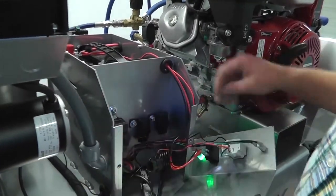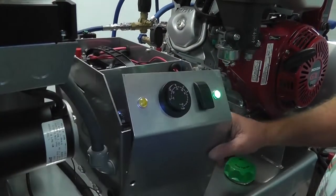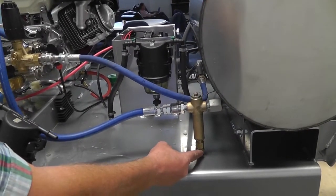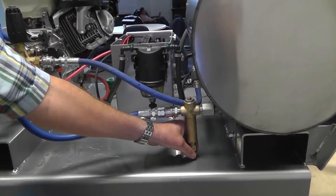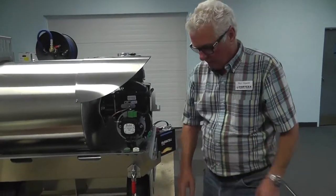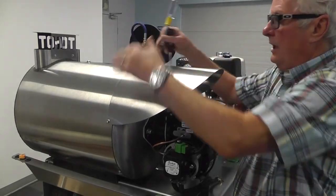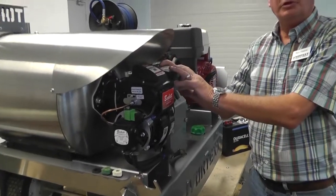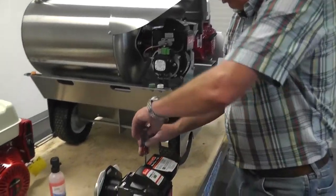If the burner will not kick in, you have a thermostat right here — that's the thermostat control that goes to the other side — and from there we'd have to go into the burner. Right here is where the thermostat is located. There is also a relief valve here on the bottom that if it causes steam in the system, that's going to relieve. If that ever goes bad, you need to replace it completely, not just reset it. If we want to work on the burner, the easiest thing to do is take out these three screws right here, and this cap will pop off so you can get into the Genesis control, where there are two fuses and some of your wiring.